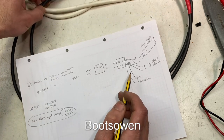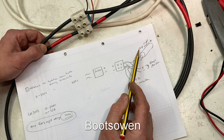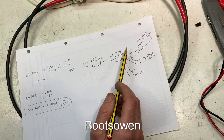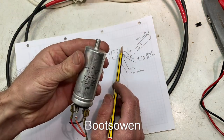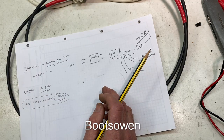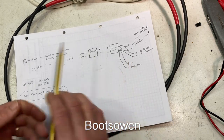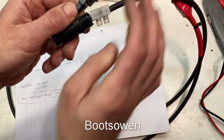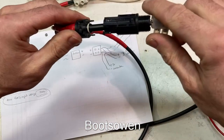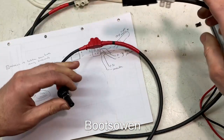Then you've got this strip connector which is here. We've got a bleed resistor across it. Any capacitor value is what it says — over 300 volts. This is just one out of a fridge or a motor I suspect; I have no idea where it came from. Fridges tend to be seven or six microfarads I think. I could have used any of them but I used this one mostly because it had good spade connectors on top. Then you run the remaining wires to the inverter. I've just used some old clips and chopped the snaps off them so they can just fit in and pull apart again without having to be unlocked, which is the tricky bit on these things.